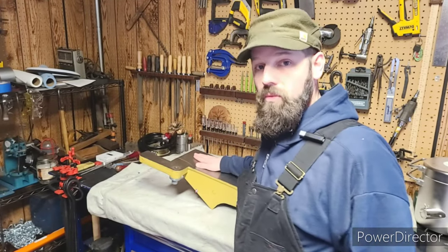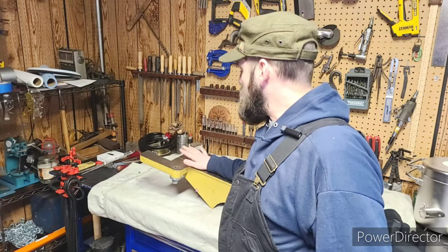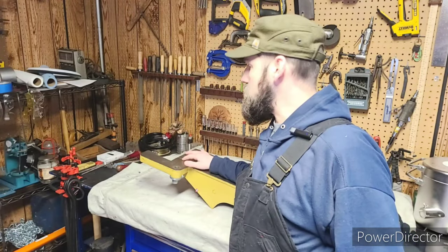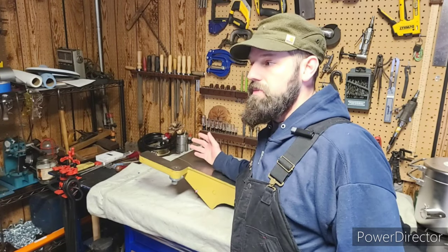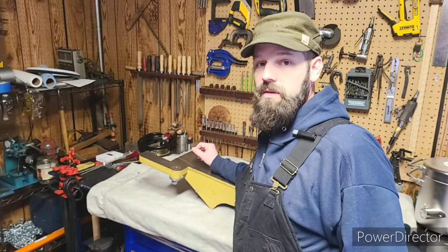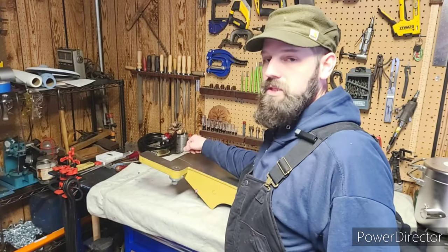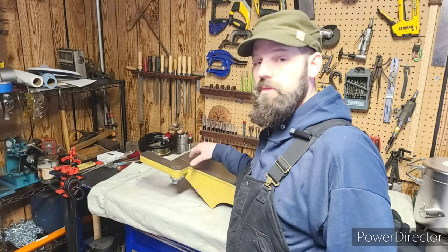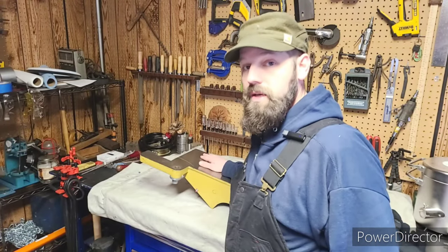The process for brazing and welding are actually very similar. With brazing, we are going to be using a brass filler and an oxy-acetylene torch to lay this bead down. The plan is to heat this entire part to the point where it is very warm — to the point where I can barely keep my hand on it. Then we are going to focus on this area here where the crack is, fill it with a brazing rod, moving our heat source along the crack and laying our brass rod in as we go. It is going to look almost like a series of really messy nickels.